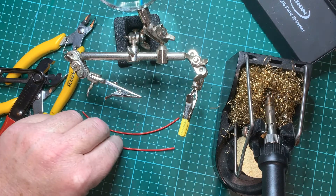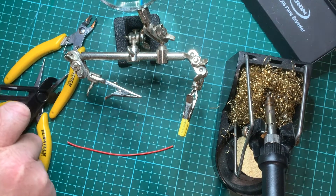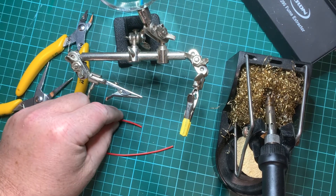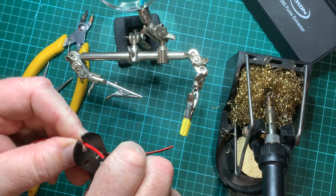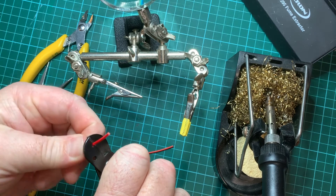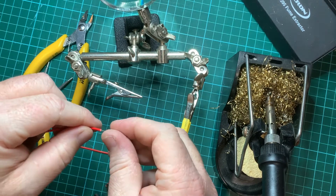I'm going to start with two wires and the first thing I need to do is remove the shield on two ends. To do this I'm going to go about 2cm back from the end of the wire and take off the shield. Grip it, give it a little bit of a twist, and then boom. It may splay the wires — that's alright, just give it a twist.